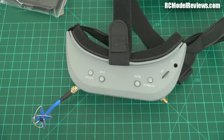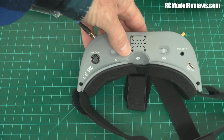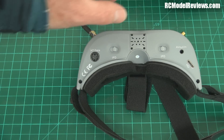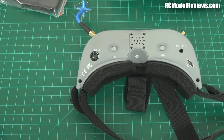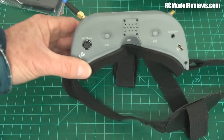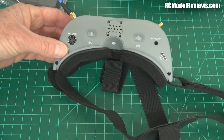You do get a bigger image - it looks bigger than the Sky Zone image, which is good if you like the immersive effect. But those lenses are right on the borderline - they can't cover the whole surface of the LCD without introducing some fuzziness. These are not cheap - no video glasses are - but they are reasonably priced. Cheaper than Fat Sharks, and they've got two very sensitive 5.8 GHz receivers. The LCD resolution is 854 by 480 - WVGA. HD is 720p, so this is only 480p; you won't get true HD even with an HD video system.